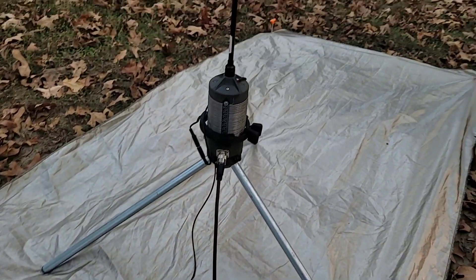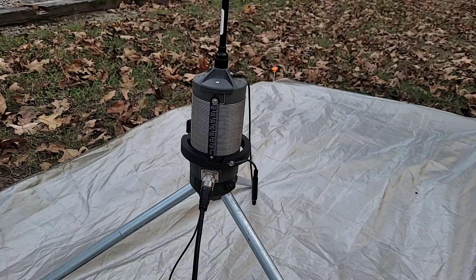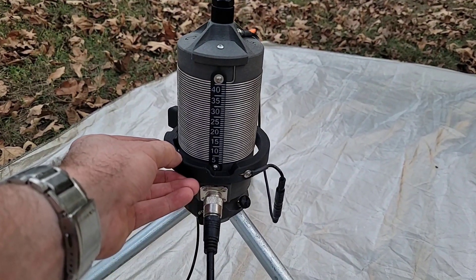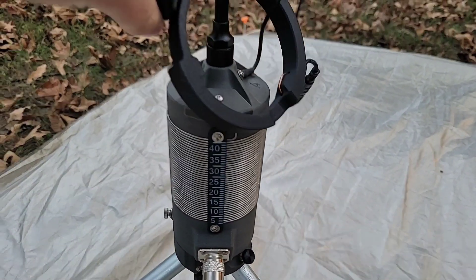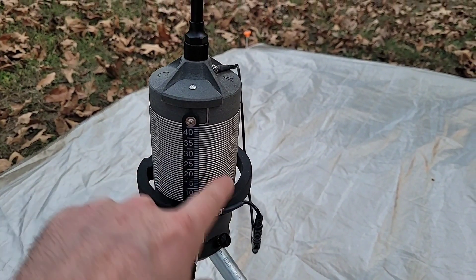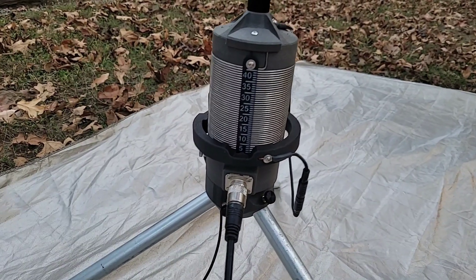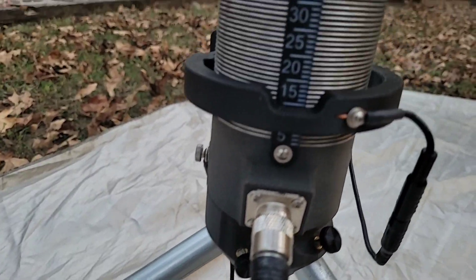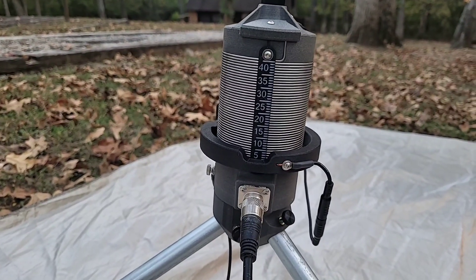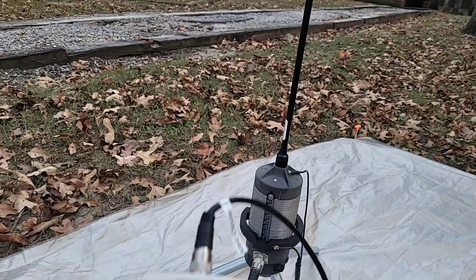So the question is how do you tune the coil? That's easy. We'll start tuning the coil from scratch. This is a nylon body with a nylon tuning clip, and inside the tuning clip is a shunt bar that contacts the coil. It sits on the interstices of the wrapping, shorts out the coil, and allows the signal to come up to the whip. You can read a chart to see where that tuning notch reads on the rule, but if you don't have that or you're using a new whip or wire, here's how you use an analyzer to do it.